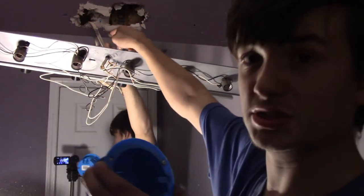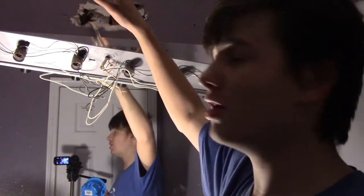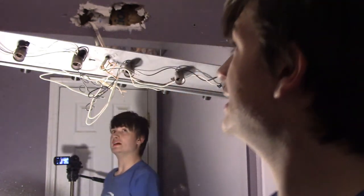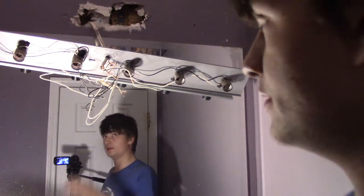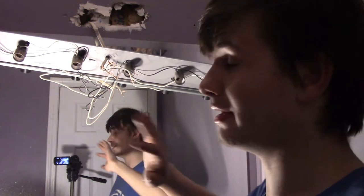I don't have a lot of wire to work with here, so I'm probably going to cut it and try to pull it out. Make sure that you don't cut your wire too short, because then you're in for a mess. At that point you have two choices: set a junction box somewhere, or run a new wire from the switch to the light — both are a major pain. The best thing is to just snip off the tangled end. I think I can actually save this wire and don't have to redo any of it.